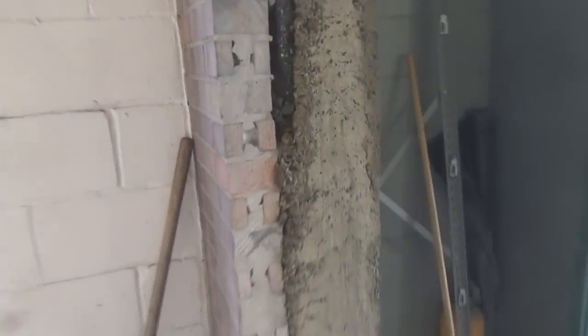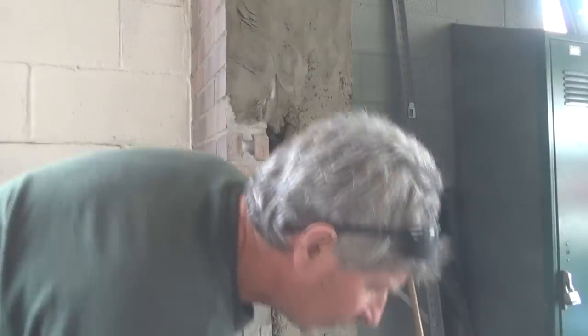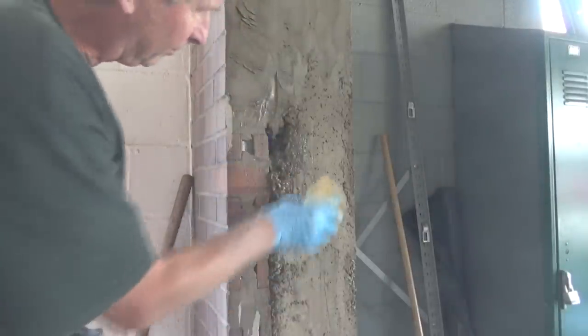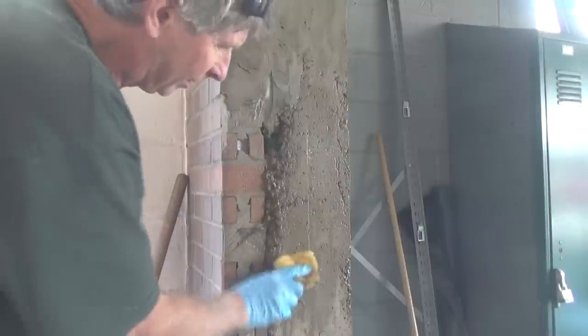Now here's the door where we had the form against — we've got little holes in here, all the way down, you can see that. Now we're going to switch to the other side. I just patched it up right here. The lintels are going to go up there — that'll be tomorrow. So I'm just going to show you how I patch it up. The first thing I do is patch it up. The lesson I'm preaching is: you wet it first. You've got to wet it — I forgot my sprayer today.